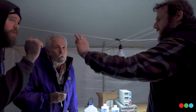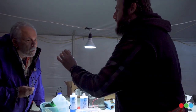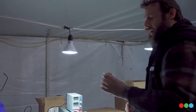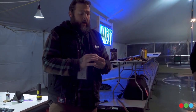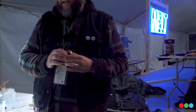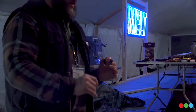So after I run this for a day or so, I go to rinse it. This is the band where we're going to accumulate the copper, and this other stuff is just going to get washed off eventually. I've learned that after running these for about a day, you get a pretty thick coat of copper. This piece would usually take me about 2.5 to 3 days of electroforming to be finished, because my style is to go very slow.